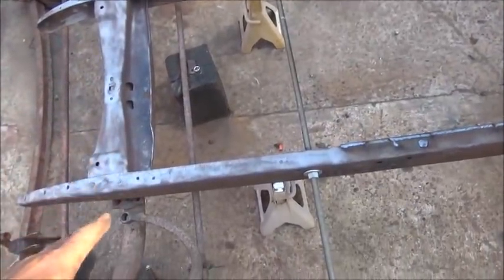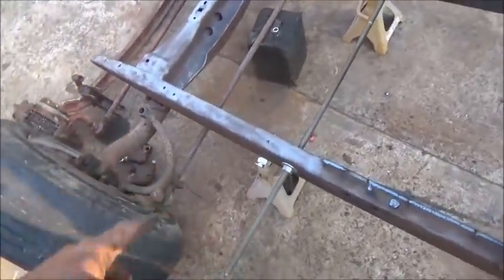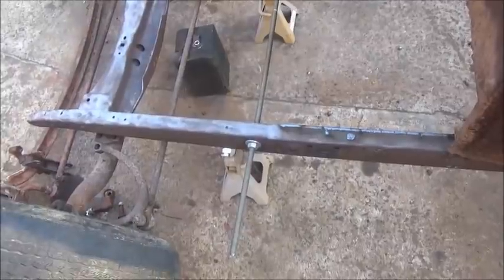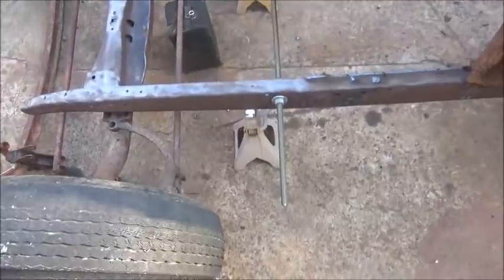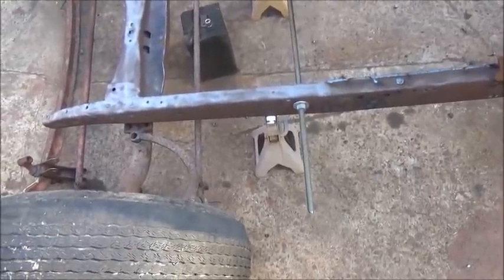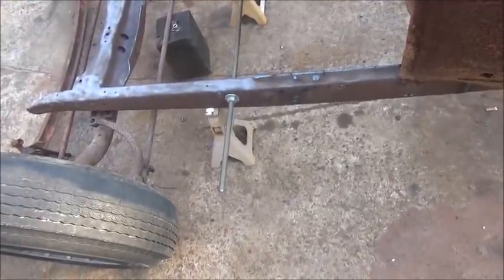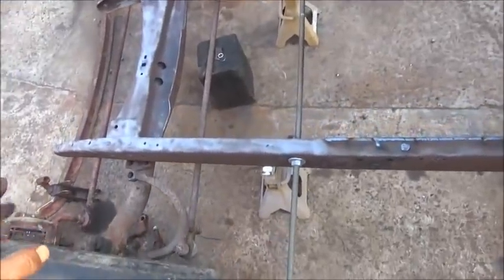That 37 inches is not adding anything in for a radiator or even adding anything in for clearance - we're 37 inches exactly. That puts us about where we're at on the other model, the roadster, even with that little V8 engine, the 239 Ford Y-block. So we've still got a lot of front framework to do, and I think that's what we'll start on next while we're waiting on our spring and other parts. I am going to make the radius rods out of one-inch solid. I know a lot of people use tubing and welding bungs, but I want to use one-inch solid and drill and tap them on the lathe.